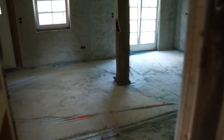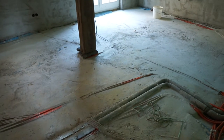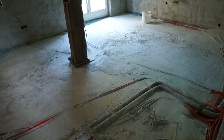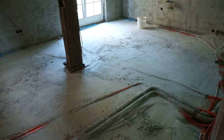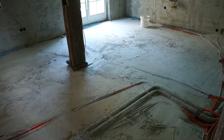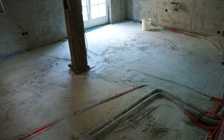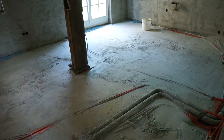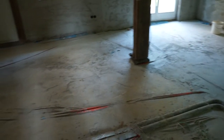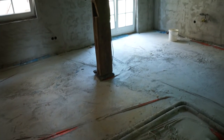In the kitchen over the past two weeks, we put in some liquid screed to level out the floor a little bit. We can't build it too high because we have to insulate the floor and then the floor heating will come in. But it wasn't perfect - it should be flat. 19 sacks of fluid screed carried up and mixed by hand, so by the time one corner was done and we moved on to the next row it was already drying out, so we couldn't get the nice leveling effect.